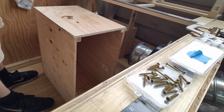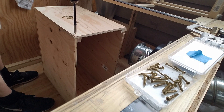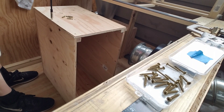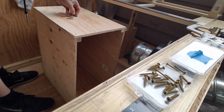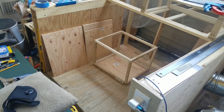The dimensions of the filter box are 24 inches tall, 12 inches wide, and 18 inches deep. These measurements have to be absolutely precise because the filter box is part of the all-in-one workbench where the dust collection system is built in. The measurements are slightly irregular for a reason. For the frame of the box, I made it from 3/4 by 3/4 inch square poplar wood, exactly what I used for my dust collection bin on the cyclone.